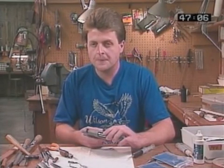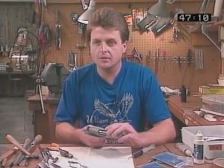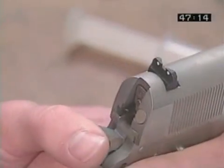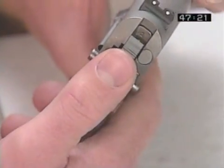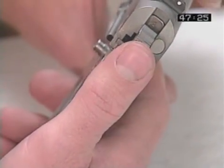You worked on that when you were working on what part again? Take-up. If you have the take-up out of it, your 80 series plunger should be pushed up out of the way, and then if you drop it to the half cock, the sear should fall straight into the half cock notch.